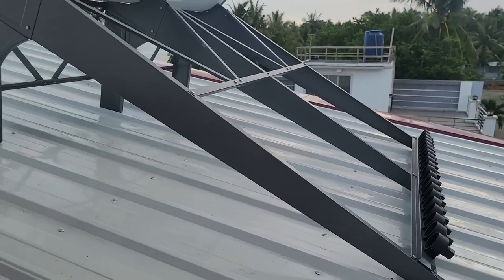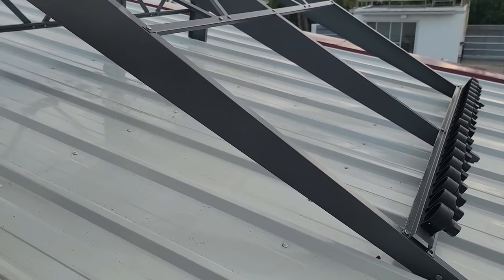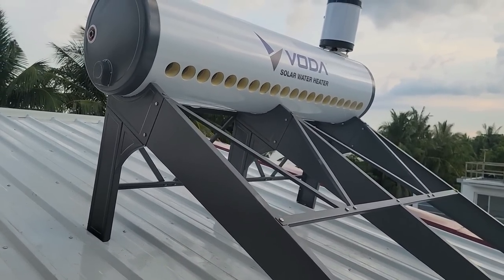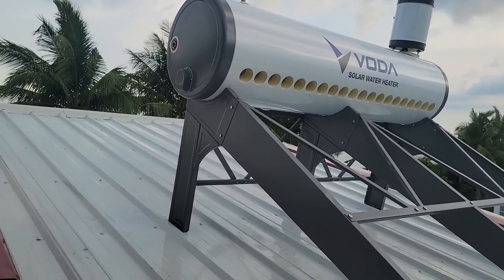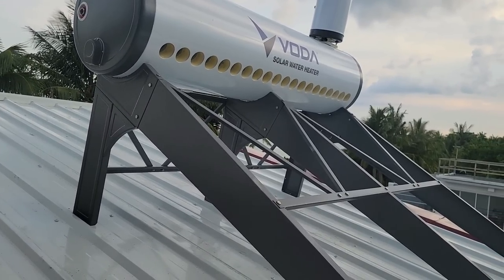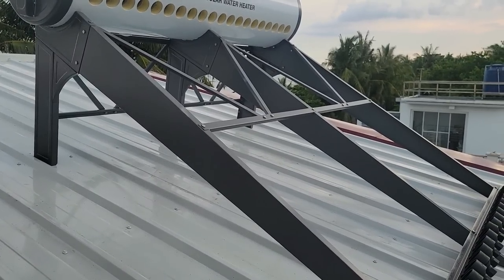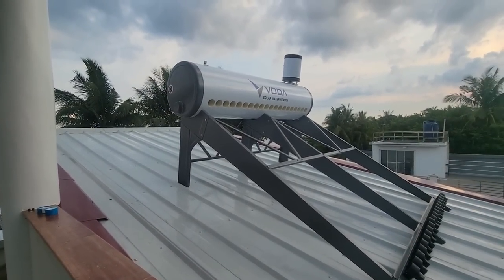Up here on the solar water heater, we've got everything but the glass tubes in. I'm not going to put those in yet — you don't want to get those tubes out into the sun until you're ready to put water into it. So what we'll do is get all the PPR water pipe connected, the valves, control wire — everything done — and right when it's ready to get water in, I'll install the tubes. I'll throw a blanket over them in the meantime because those glass tubes sitting empty in the sun will get super hot inside. That'll come up this next week.